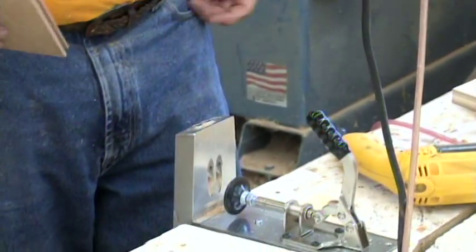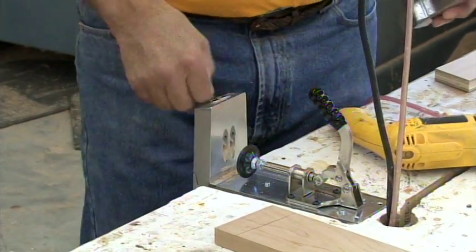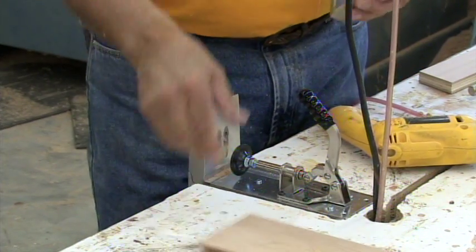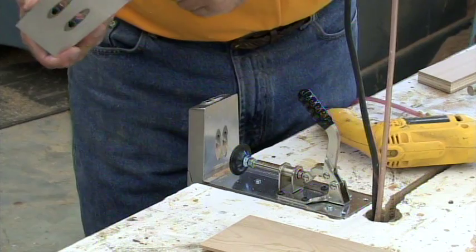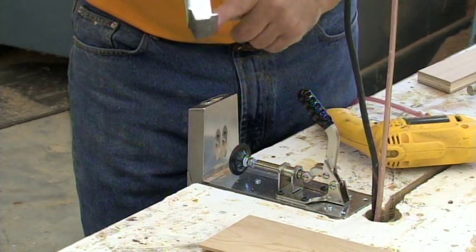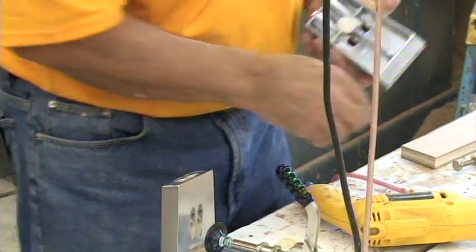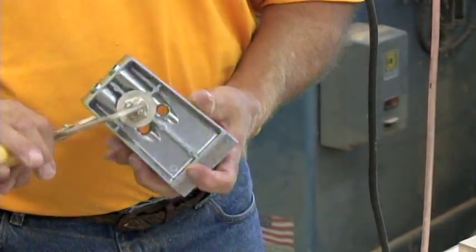All right, another thing I like about this jig, the reason we call it a 3-in-1, is because this upright here can be interchanged. This upright is for 3/4 inch stock or 1 inch, 7/8. We have an upright that can exchange here, come into here for 2x4 stock. All it is is 2 screws on the bottom, intersect this one with this one, and you're ready to go. And you can see when we took these out, we put a little lip on here. Why? Because on the back of both these uprights, we have a magnet.